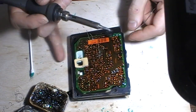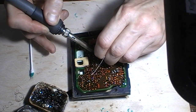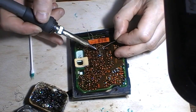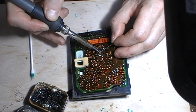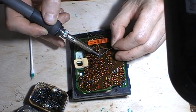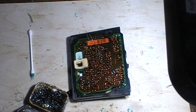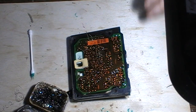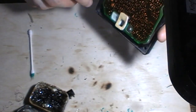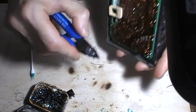So you solder with lead, it's the best for repairing. Now, you guys might not be able to get hold of lead solder. So don't buy your solder off eBay, it's rubbish. Doesn't matter what it is, it's rubbish. Unfortunately, a good roll of solder today is over £30, so if you're not spending that, you're using junk. And of course the surface mount we do using paste first and then finish off hand soldering, just to make sure that it's a proper fillet, a proper joint.